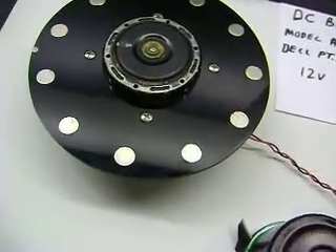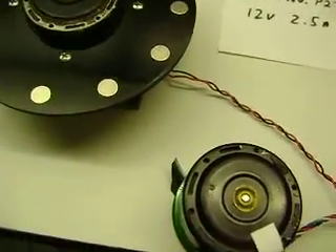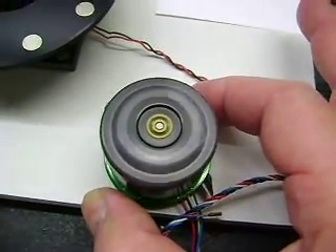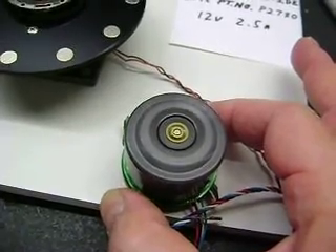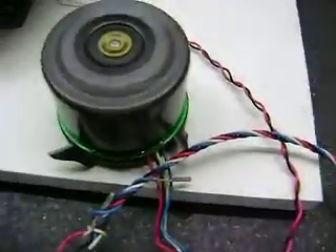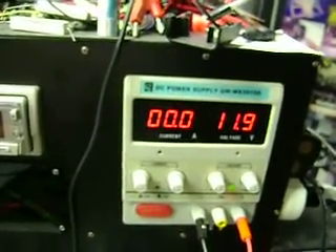I'm going to disconnect the power and get this one on. I'm just going to hold it. That's its top RPM. It bounces a little bit back and forth — it doesn't have the load on it anymore, so it has a little bouncing until it levels out. This is the current while it's at idle without any load, basically other than itself. If I take this plug out over here, let me slow it down just a little bit, and we'll watch the amps climb as it goes.